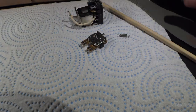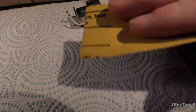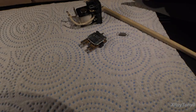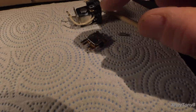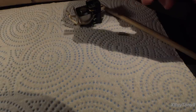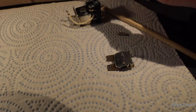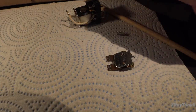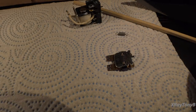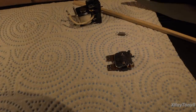A contactor has a very thick material on it, and when it gets kind of pitted, you can burnish them with this type of material, and you can do that a couple times. They're designed for it. These are not. The only recourse is when they start to go, you replace them. If they get a little bit of dirt on them from age, a little bit of tarnish, if it's a cleanable tarnish, literally just a little bit of contact cleaner, and I don't mean DeoxIT. DeoxIT leaves a residue. You want contact cleaner that's designed not to leave any residue.